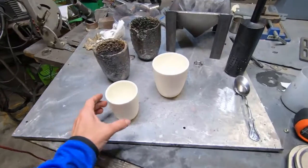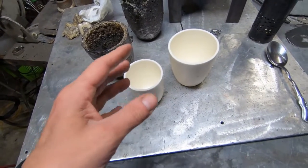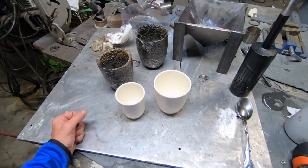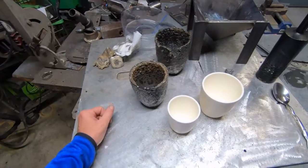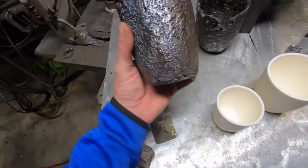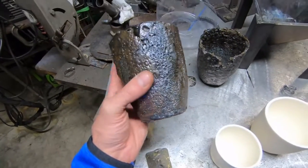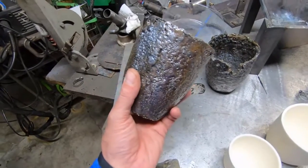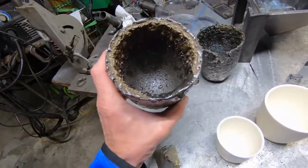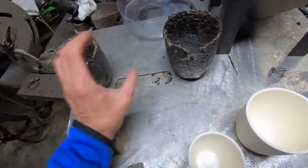Today we're doing a video about crucibles — it's very hard to determine what is a good crucible and you've got to spend a lot of money to figure it out. There aren't good videos online, and since YouTube has disconnected comment sections you can't get feedback anymore. These are some ingots I've poured over the last couple of days using salamander super crucibles — very good compared to cheap Amazon models that claim to be silicon carbide but are actually just graphite, and graphite burns in oxygen.